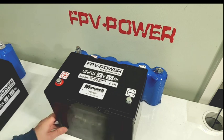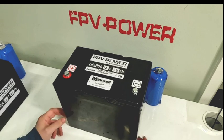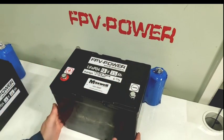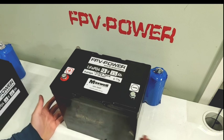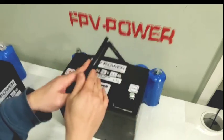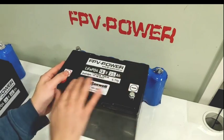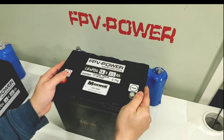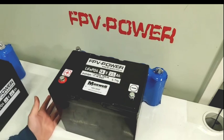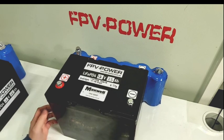And when we're talking about a good AGM for cranking, Optima, the red tops, 800 cold cranking amps, and those are AGM, special spiral AGM, they call it. That's $350, and they're on special, $320, $330, but $350 for an AGM which weighs like an elephant, versus $380. You've got fantastic technology made by Maxwell Technologies, an American company, with lithium iron phosphate, the latest lithium batteries, and at 6.7 kilos, $380. Crunch some numbers, as you can see, it doesn't take much to come to the conclusion that this is the way of the future.